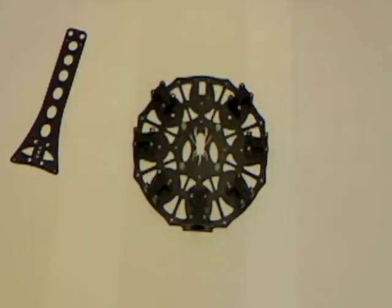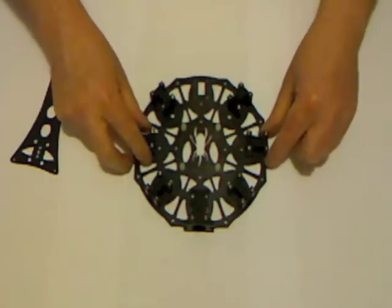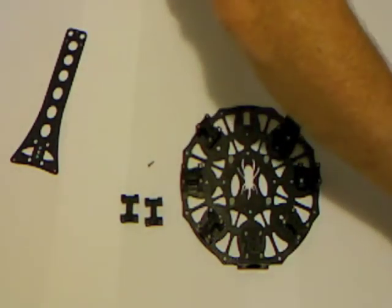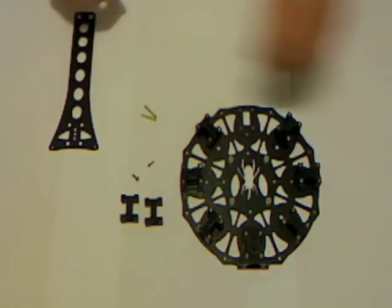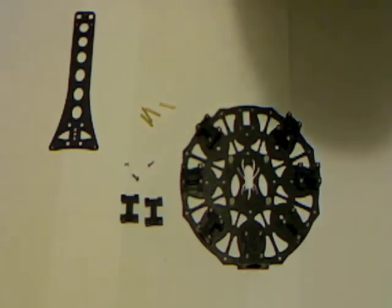Plus I'm going to show you some tricks I use when I'm actually putting the blocks onto the base plates. There's a little technique I've developed which just makes the process a lot easier, because as you fit them, you need to align them. So what I've got now is the 2 blocks. I've got 4 of the 8mm screws, which on the Vampire are what is supplied for the base plate. I've got a pair of washers that are supplied with the tail. I've got an M3x8, and I've got my 4 pins, and lastly my M2x5 screw, which is going to go in the top corner to hold it all in place once I'm done.